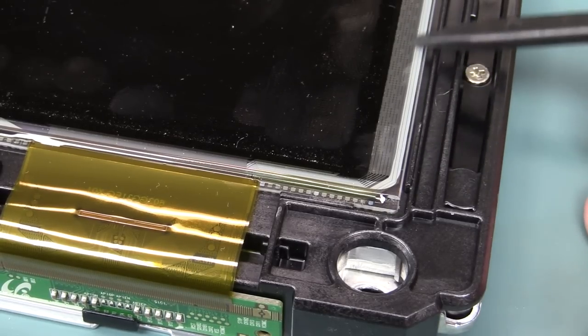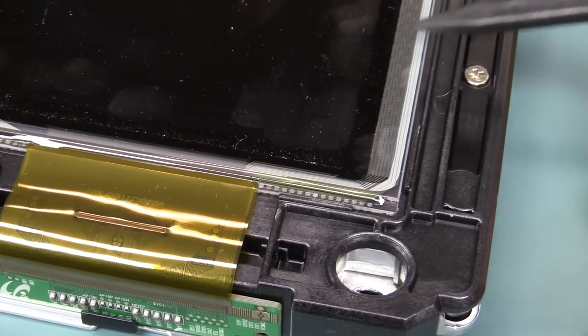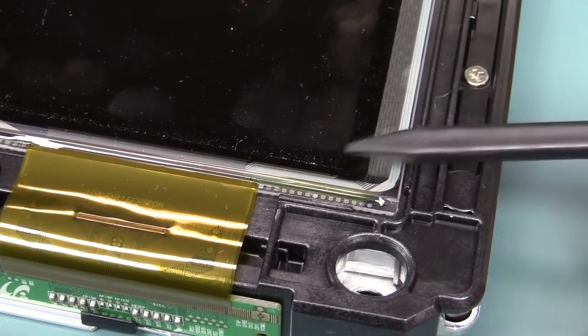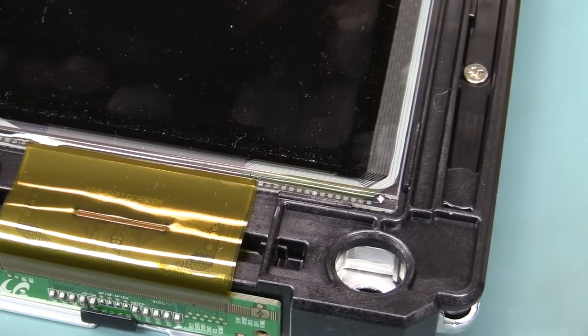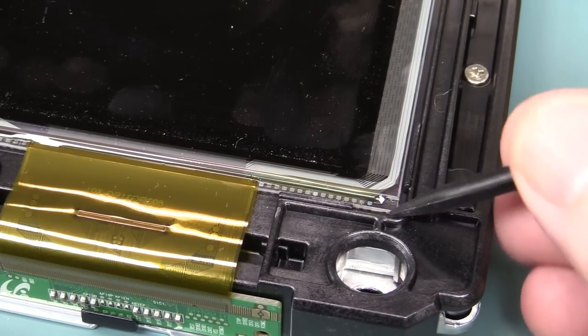So I'm not sure if there's any chip on glass drivers under here for the horizontal. I'm not actually sure of the exact mechanism they're using to get all of the 1080 traces — they might be doing half on one side, half on the other maybe. I can't really get the entire glass panel out to take a look.